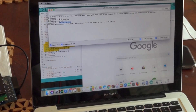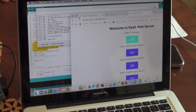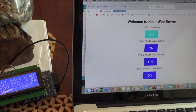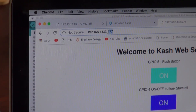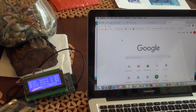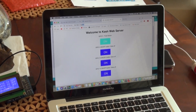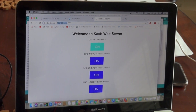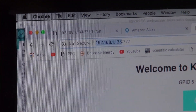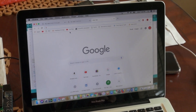I'm going to copy the IP address from the serial monitor and paste it into my browser - it presents the same control page. Now what you need to do is go to your router - whatever brand you have - and port forward this IP address with this port number. If you do it correctly, go back to your browser, type 'what is my IP address', get that external number, put a colon after it and then the port number, and you should be presented with the same page. That external IP address is your network's public address.